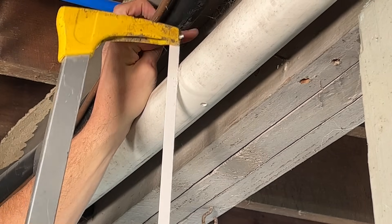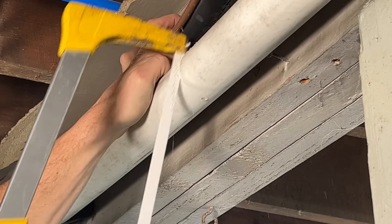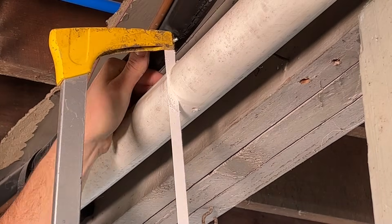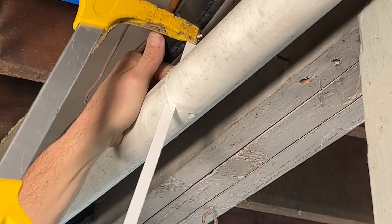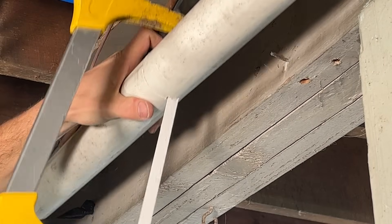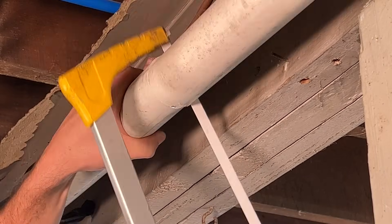Let's jump in. I'll show you how to cut this pipe and start with the first method, which will be the push-to-fit coupling. With your hacksaw, with a new blade and the teeth facing forward, you're going to see the pipe jump around while making this cut. A few tips: one, do not apply much pressure down — just do fast short strokes and it should help you get through the pipe. Two, make sure you're not pushing the pipe where it's going to pinch the blade, or that will stick the blade and make the cut much harder.